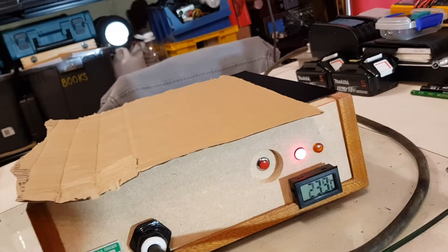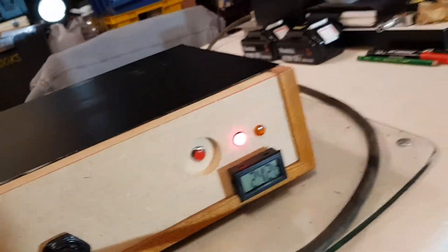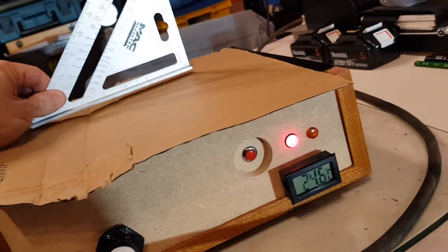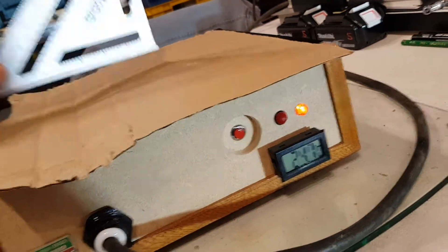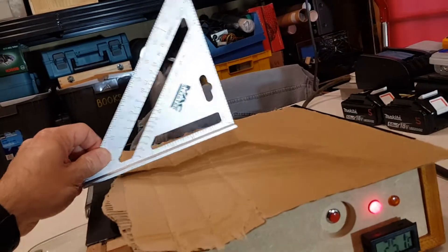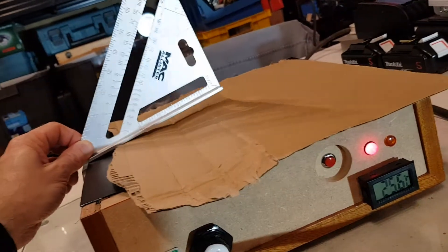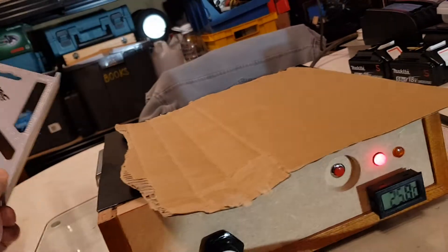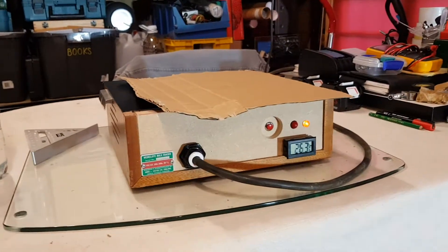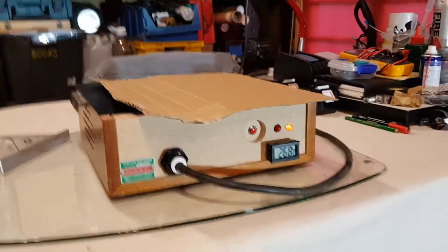It's really quite a strong electromagnet. Aluminium is interesting with electromagnets — this square here is aluminium, and the magnetic field repels it. It's floating. I mean, I can't let go because it will just get pushed off the area where the field is strongest, but genuinely I'm not trying to hold that up. As I move it down, there's a point where it's at maximum lift. With a permanent magnet there's no attraction at all, but with this electromagnet there is a repulsion.